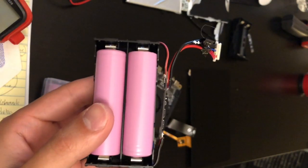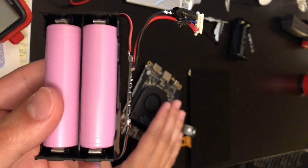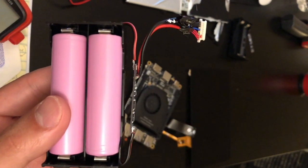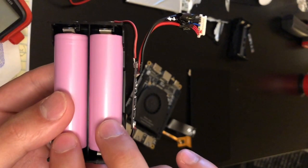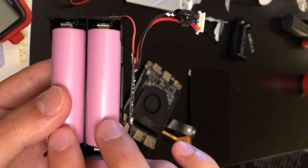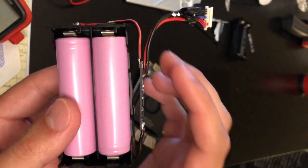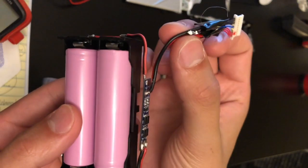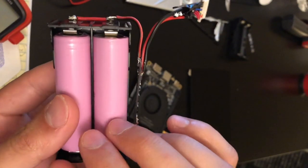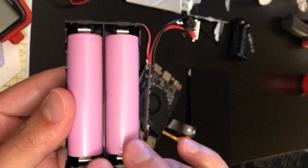So let's go over the battery pack. First off, it's a 2S battery pack that the Latte Panda Alpha requires when you use the 10-pin battery connector, meaning you need two cells in series to get the required voltage. One of the good things is that it should be scalable — if you make another identical pack, you should be able to chain it into the positive and negative leads to create an effectively double-capacity battery pack, though that will come at the cost of charging speed.